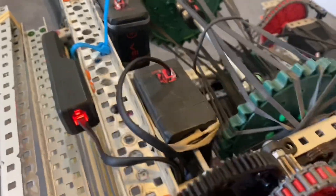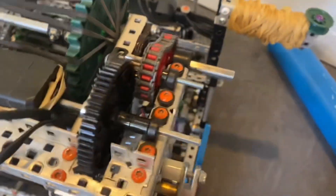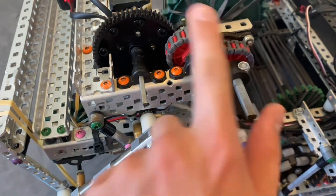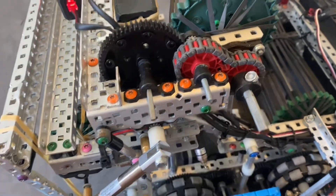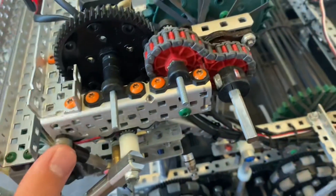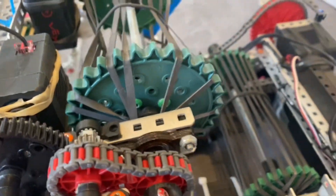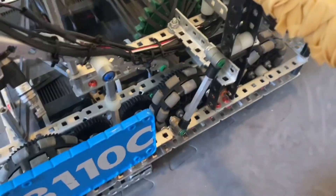So we had to change it to 600 RPM, and I actually just shaved down a high strength gear because I didn't have a low strength in my house — it would just be five-to-one. This is a two-to-two just because I also didn't have eight-tooth sprockets in my house. This one runs at the same speed but it's slightly bigger, so it moved faster than the bottom, but we didn't find any problems with that.